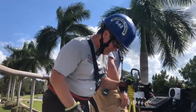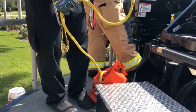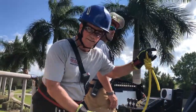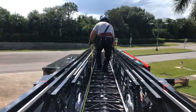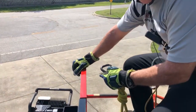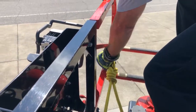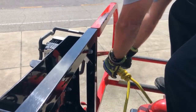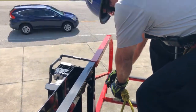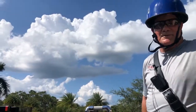We're ready to set up our fall protection on 339. We're going to take the bag of rope and the lifeline with the carabiner attached to the end of it, run it up the ladder, and hook it in at the anchor point at the end of the ladder. We're at the end of the ladder now — we're going to hook our lifeline in at that little eyelet right there at the end of the ladder. That's our anchor point. We want to turn the carabiner the right way, lock it off, then turn back your quarter turn and test it. We're tied in at the top and we're ready to put this into action.